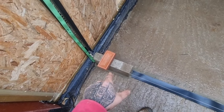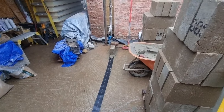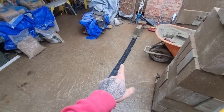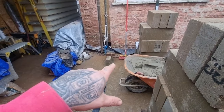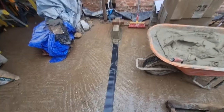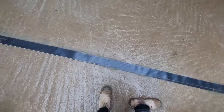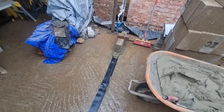I've set my first block there, so I'm going to do my bond off of this end. I've dotted one down the other end — I don't know if that's in the right position yet. We'll find out as I run four blocks this way, but whatever it is, it's going to be a cut up that end anyway. Look how the damp tray's all stuck down nicely, not blowing around — happy days. So we're going to run these through here now.